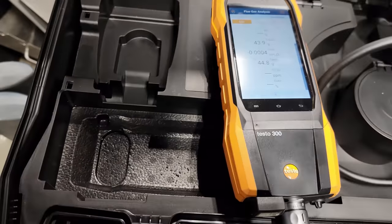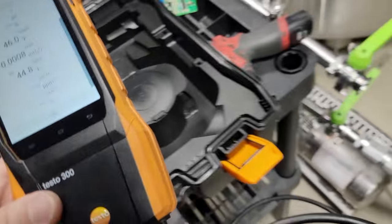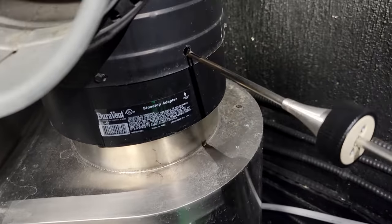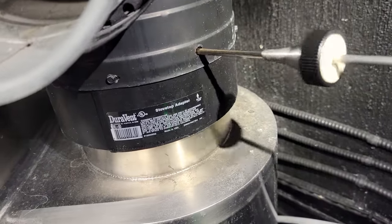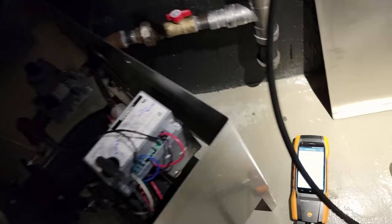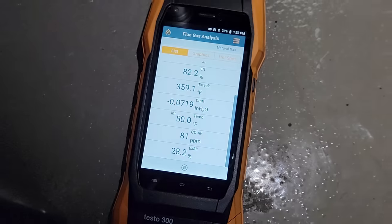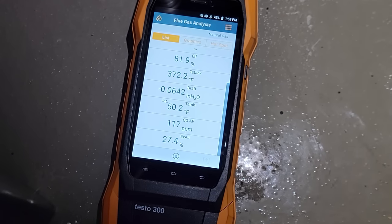So this has been running for a little while — just long enough that we're able to get what we need and not trip over it. Let's go ahead and set it on the ground so it's safe. Stick this in here — that is right in there about the halfway mark. You can screw that in to make it nice and tight and we're able to check our draft. They don't need a lot of draft. We've got 0.06, so we could actually adjust that just a little bit — go for 0.1. About 0.1 was what we needed. The more we go up the chimney, the more we're losing.